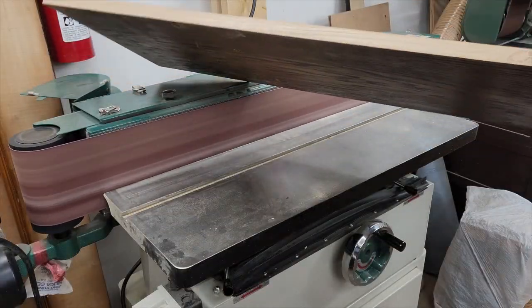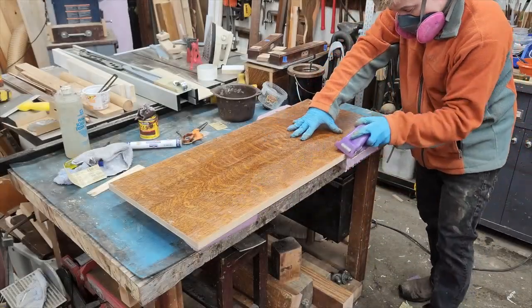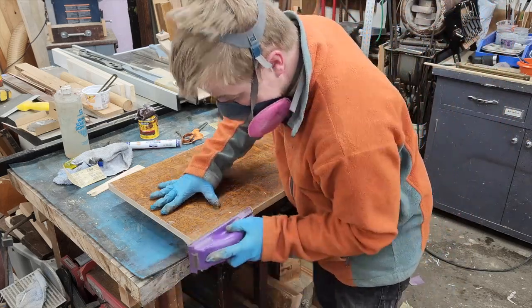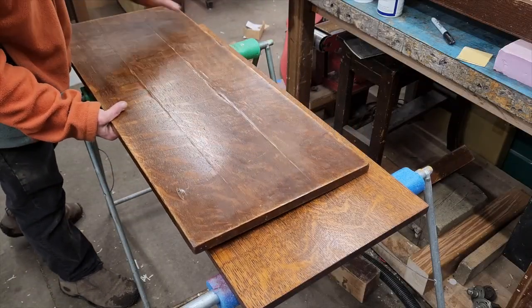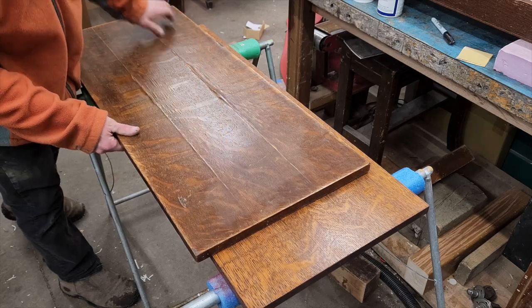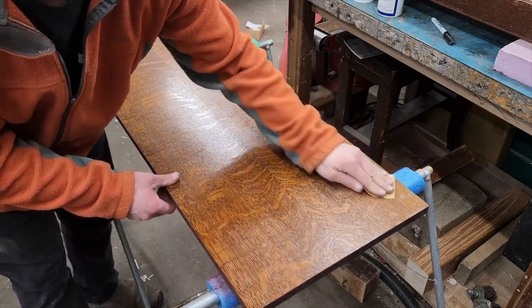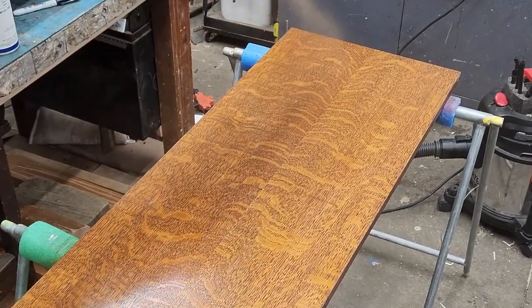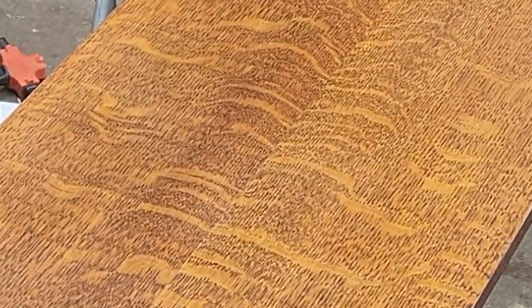Much better. Purchase validated. That cleaned up just fine, and I think we're finally rounding a corner on this project. With the board cut to size, now comes the hard part — color matching. This new board was refinished at some point, so I'll scuff sand it with some 320 grit and then hit it with an aerosol toner to try to darken the color. Thankfully the toner allowed me to fine-tune the color without having to completely strip and refinish the board.